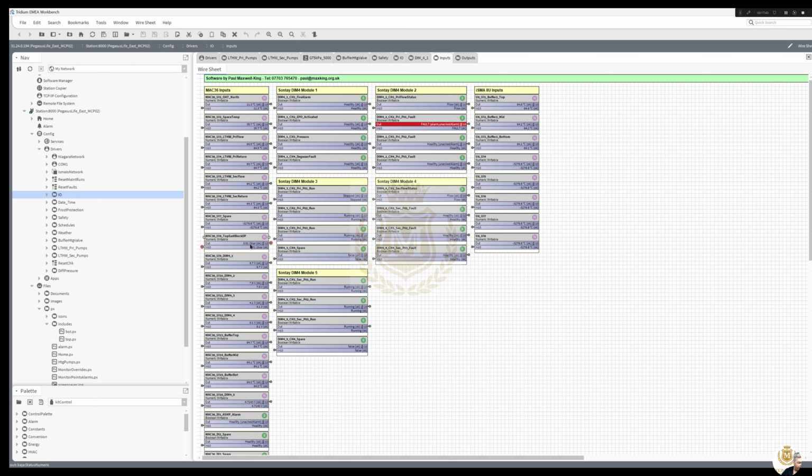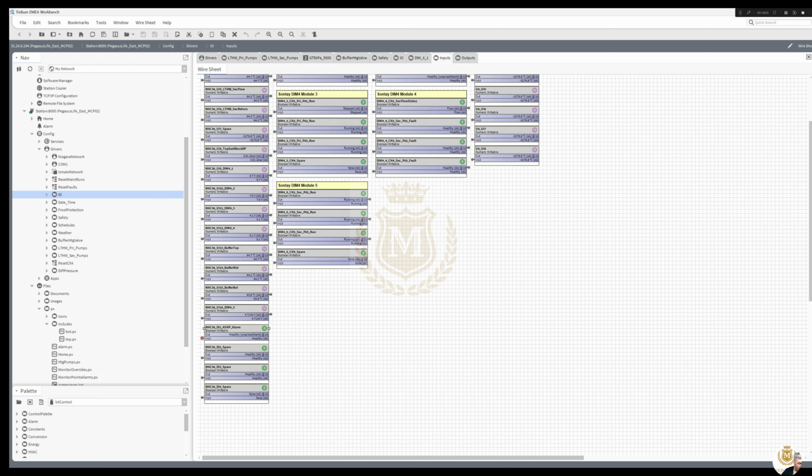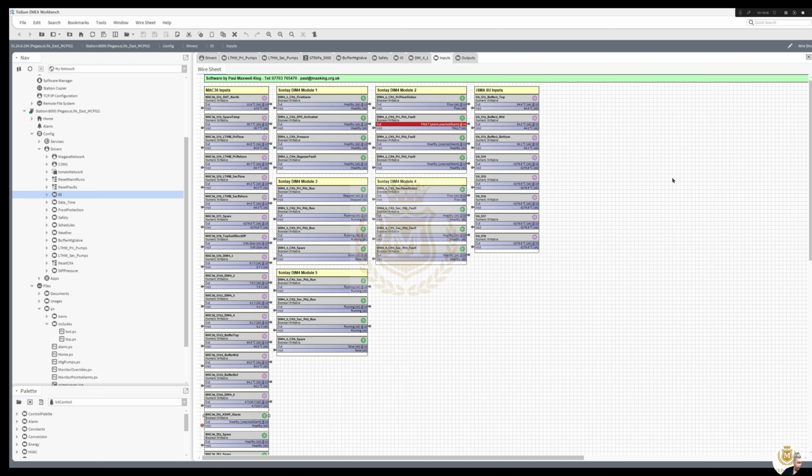Top of the block pressure. These are our DIM modules, so we're using one universal input to monitor four digital inputs. The buffer tanks, another DIM module, air source heat pump alarm, and spares there. These are our DIM modules, so each DIM module, DIM module 1, those are my inputs from there, DIM module 2, 3, 4 and 5,